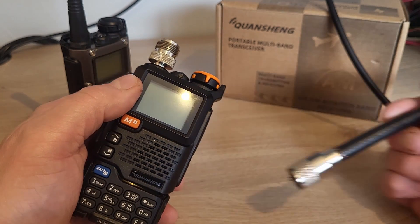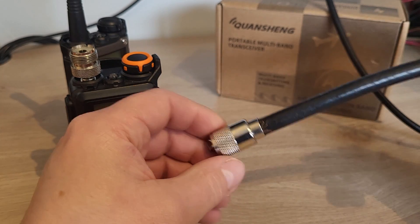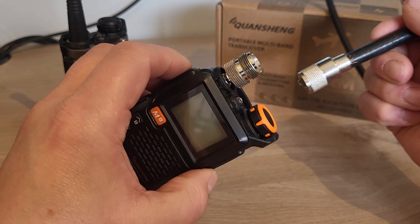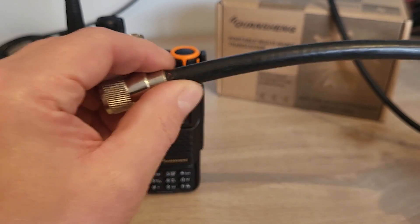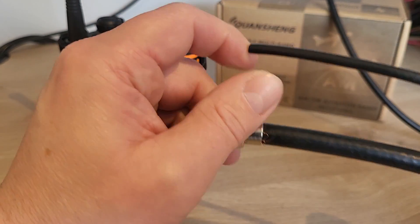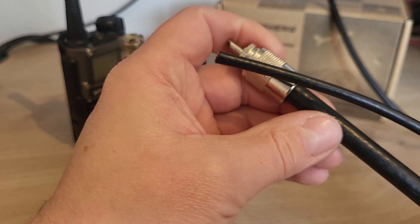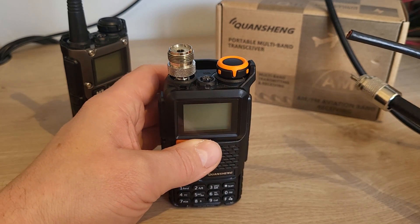The only thing you really need to think about is what type of coax you're going to feed it with. I always use a thicker coax — this is RG213 — which is great for feeding into the shack, but if you plug that into the little adapter on top of the radio it's quite heavy and you could end up snapping things off. You might need to use just a short patch lead. For longer runs, you certainly want to use better coax rather than RG58 — you can see the difference in size; RG58 is far more lossy. Don't use cheap coax, because you're wasting the benefit of having a decent antenna. Always go for better coax, but you can make yourself a short patch lead just to stop the top of the radio getting damaged.